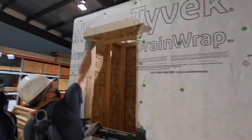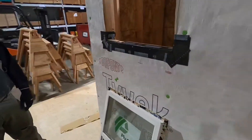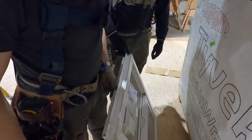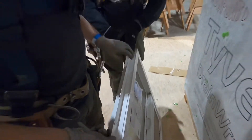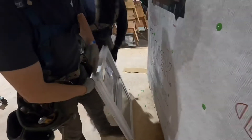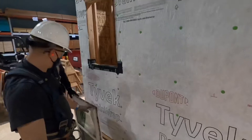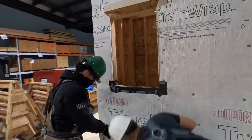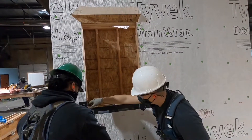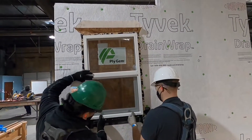The head goes right on the wood. Double and triple check — take a clean rag with mineral spirits and make sure you're cleaning that window nice and well. Even a brand new window from the factory is going to have oils on it. Clean it very well with mineral spirits or denatured alcohol so you have a good bond. When installing, put the bottom in first resting on top of the shims, then tip the top in place so it doesn't push the caulking or the shims.